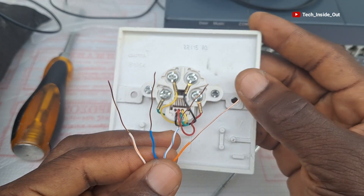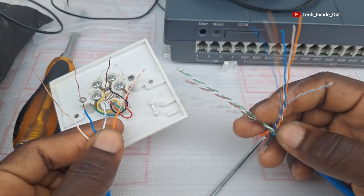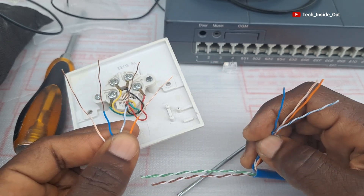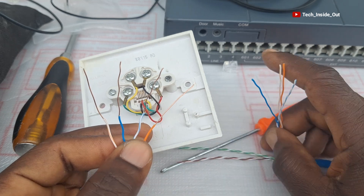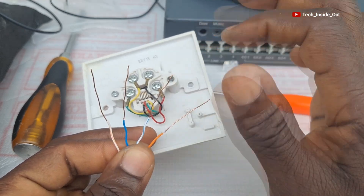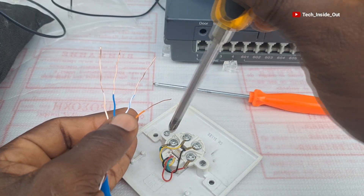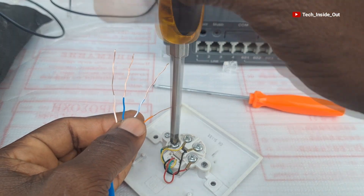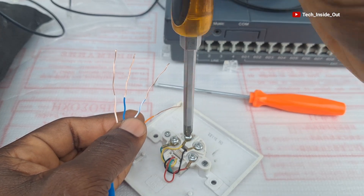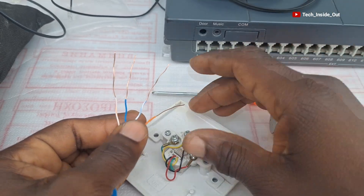Let's do that wiring. Remember, at the other end of the CAT6 cable the same convention must be followed in the termination of the RJ11 modular plug as well. But before that, let's wire the cables to this socket first by loosening each of the four screws behind the points where we'll be inserting the cable.